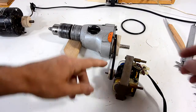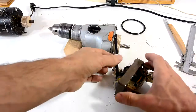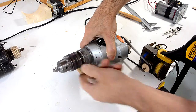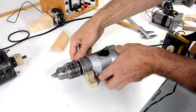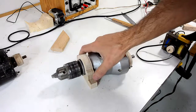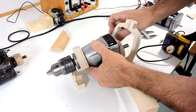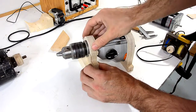I need to put the motor on this side to spin the drill this way, because otherwise this spiral gear is just gonna make this part pop out. So I may just barely have enough power here and I need to somehow rigidly mount this thing. I've made this bracket so far, but then I realized it might actually be much better to have this a little bit further off of a base so I could put a bigger cam on here. So I made this bracket that goes on here, and then a spacer brings this up.